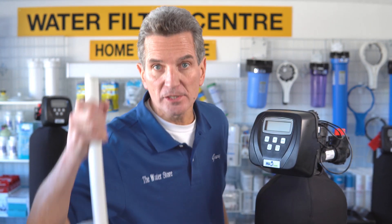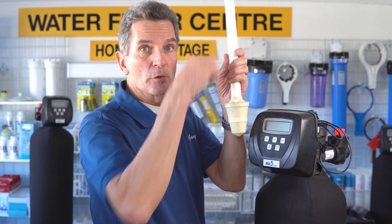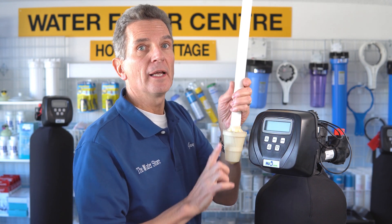As the water passes down toward the bottom of the tank, it gets to this riser tube. This riser tube runs the full length of the tank. At the bottom of the riser tube is a screen or mesh. Water flows down, enters through the screen, and then heads up through the top and onto your whole house, cottage, or cabin.